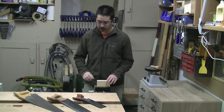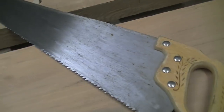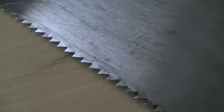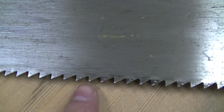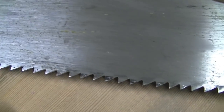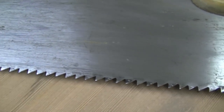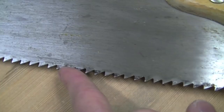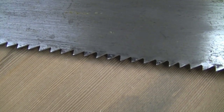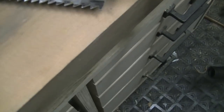Let's have a look at some hand saws. This western style rip saw shows the teeth quite well — typical of what you find on a western saw. These teeth are rather large, about four teeth per inch. The geometry is such that the hook angle — the angle of the cutting face — is about 90 degrees to the blade. I can check which way the teeth are facing by drawing my finger across; it runs smoothly one way but catches on the teeth the other way. This is significant because on some saws with finer teeth, you won't necessarily be able to see which way the teeth are pointed, so you have to feel.